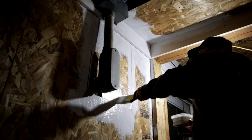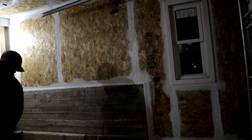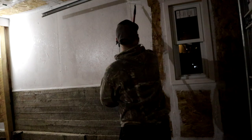Fresh wood is quite thirsty, and I ended up using 7 gallons of paint to properly coat the shop. I chose a flat finish paint for the first coat, just since it was half the cost, and I did a finish coat with semi-gloss, being a lot more resistant to grabbing onto dirt. It'll be cleaner in the long run.